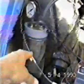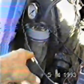I don't know if you get a good picture on that. There's mesh in there, a center electrode, negative or positive, doesn't matter, and then a floating unit that's not connected, insulated from everything else, and then an outer mesh, filled with water, a teaspoon of caustic in about 4 liters, so this is about a quarter teaspoon to 2 liters.